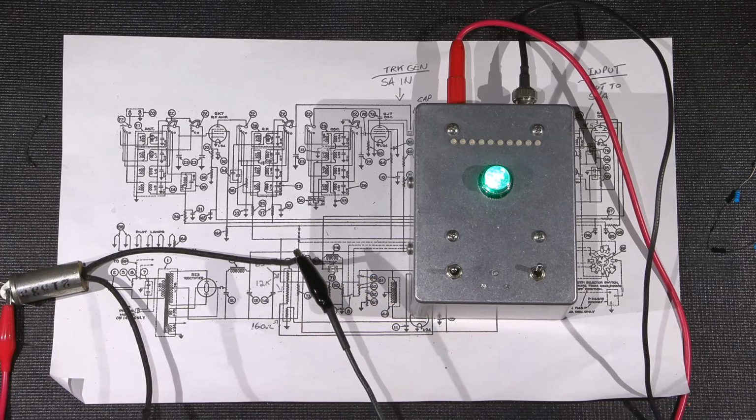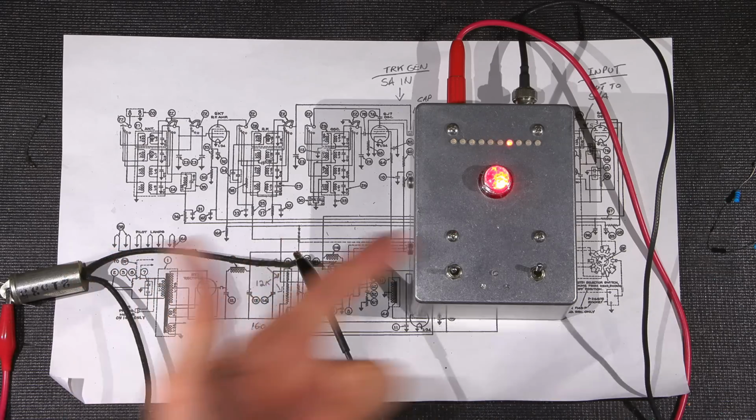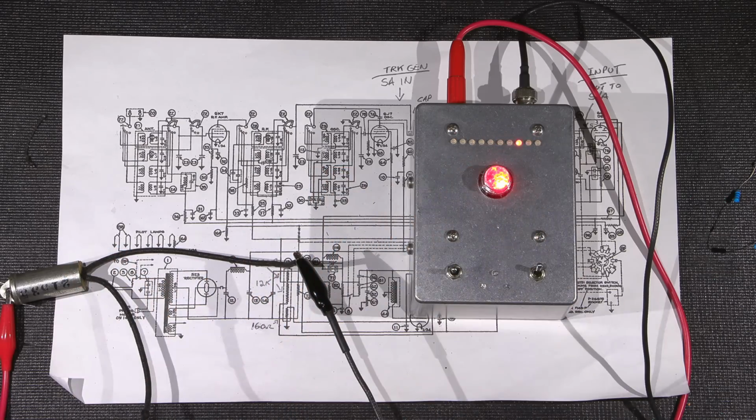And this one here is open. Oh, no, it isn't. So this one's on the verge of shorting out. This would have been the side that would have most likely caused very bad issues. You can see this thing? It's in the red scale, and it doesn't know what it's doing. Look at that. So right now, if this was attached to a line cord, it would be shorting out. It would be sparking and doing all sorts of things inside there because it's intermittent. And as you can see, it's intermittent in the red scale. So it's really, really bad.